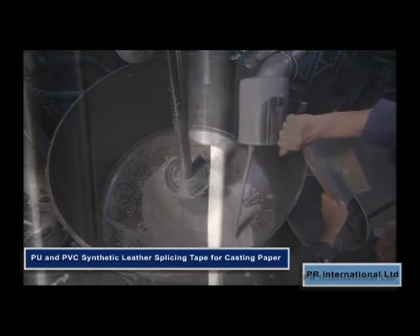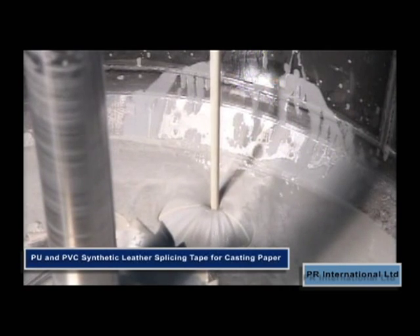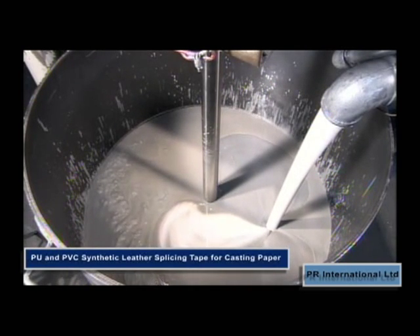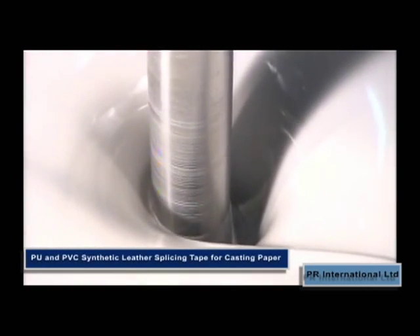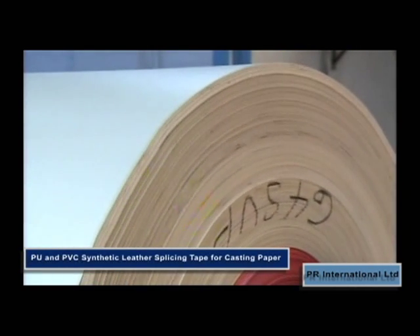In the production of artificial leather, a petroleum-based plasticiser is mixed with an ultraviolet light stabiliser and flame retardant solution. For polyvinyl chloride, powdered vinyl is added with colouring agents. This mixture is then cured in stages in an oven.